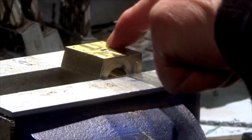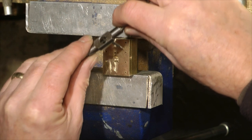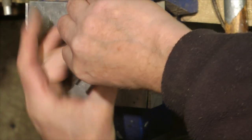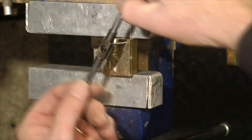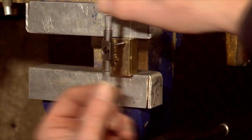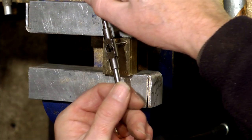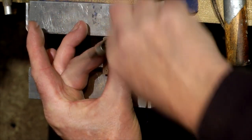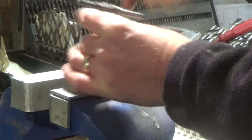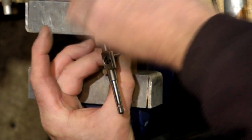Just drilled the remaining holes on the cylinder block and now it's just a case of tapping these remaining holes with a 10BA tap — going through first with what they call the plug tap. This is where you've got to be really careful with these taps; they're quite fine and can snap very easily, so it's a case of taking it very slowly. I've just got to the bottom of the hole, I'm going to feel the resistance, then very carefully take this one out and go along to the next hole and repeat the process.